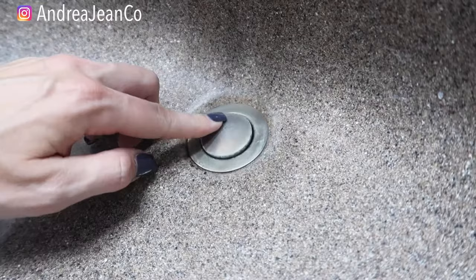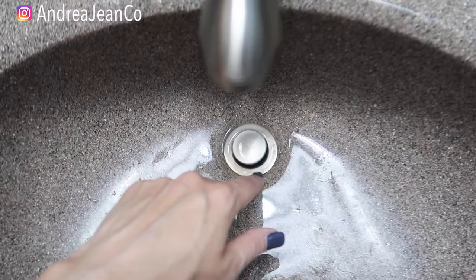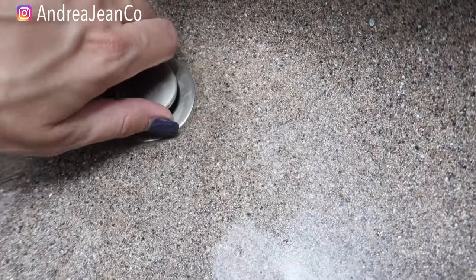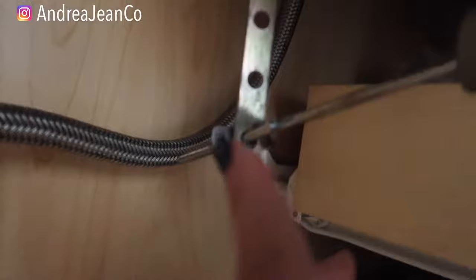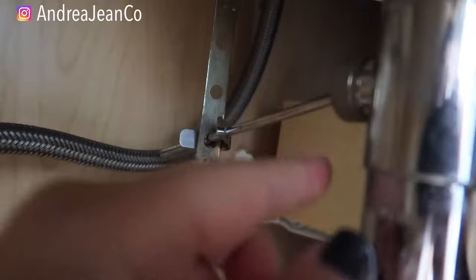My hole here is very small, so I might actually lift it a little bit more. I went ahead and raised mine up a little bit so that there was more area for the water to flow in — let me tighten that a little bit. I moved it to go on the bottom so that it would raise up as high as possible. You do want to make sure this is tight right here because there's a little ball in there that helps it move up and down.